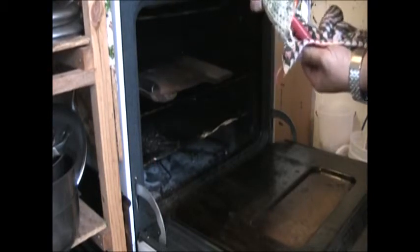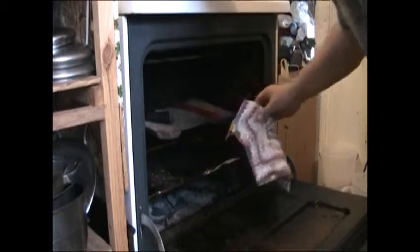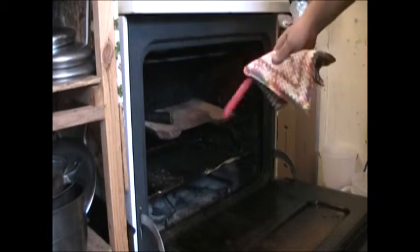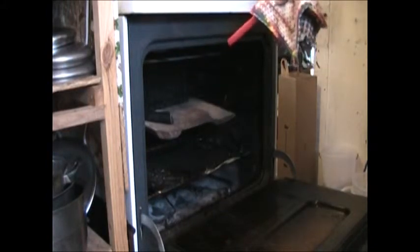Well, it's soft, it's hyper-flexible, but it would still hold 20 PSI at 250 degrees. The poly pipe is very soft but would still hold 20 PSI. We'll turn it up a notch and wait half an hour. Half an hour at 275 — what do we got? The black poly pipe has gone all soft and squishy — this is very, very soft. You wouldn't want to put 20 PSI on that, like wet noodle territory. So this PEX is good for 250 degrees at 20 PSI, and you'd probably get away with the poly pipe for the same temperature.